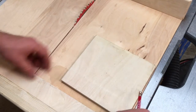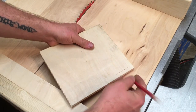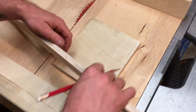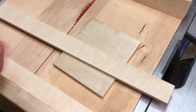To attach the sides, I'm going to make a rabbet cut that's going to let this board sit in about a quarter inch. Then on the sides I'm going to make a dado that's going to receive a board that'll slide into it as its cover.